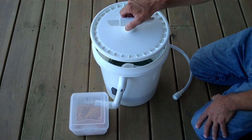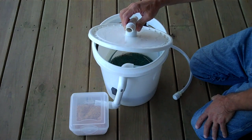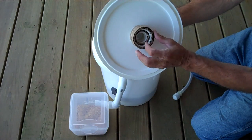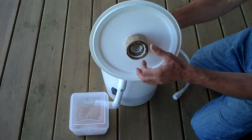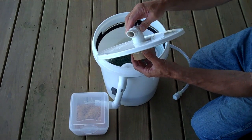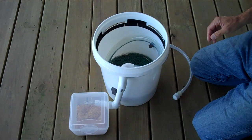The ventilation system was the first thing I'll cover. This unit, the new version, has a vent on the lid which is made out of standard PVC fittings. A T-fitting penetrates the lid and attaches to a reducing bushing on the bottom. The angle on these pipes is meant to prevent too much rain from getting inside the unit — it would take a pretty strong wind to blow rain in at that angle. So that'll vent the hot air out the top.